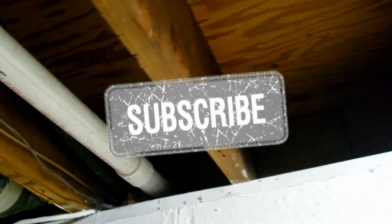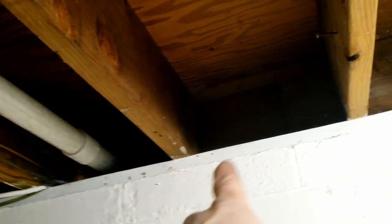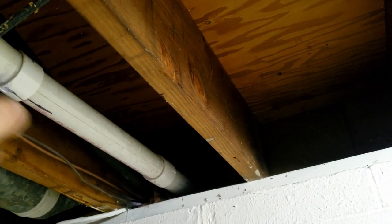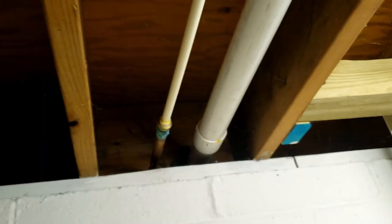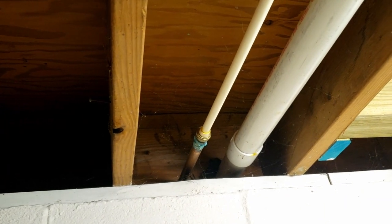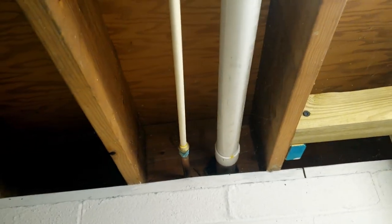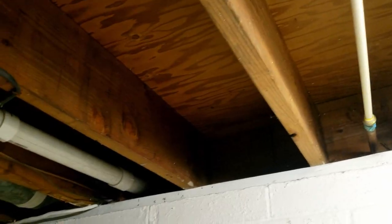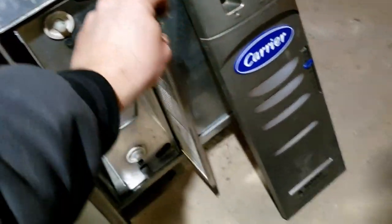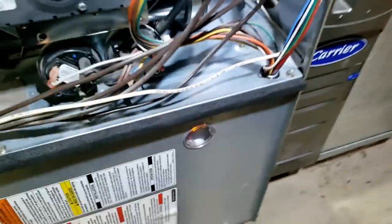I think what I'm gonna do - since they've got it the way they've got it, I'd love to come out a new hole, but that would be bad since it's hidden behind the air conditioner. I'm gonna go pick up some pipe, chop that off, get a new piece glued onto it, bring it over, put it close to this, shoot the exhaust out, and bring the air intake close to it. It looks rough on the outside but it's hidden behind that air conditioner. There's no good way. This is one of those judgment calls. We checked the filter - it's fine. I'm gonna go pick up some new pipe and get that replaced, otherwise it'll get glued again and have problems.